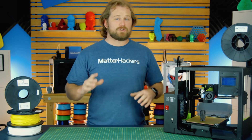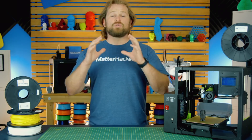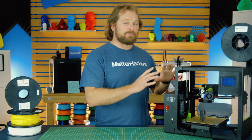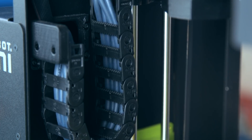There are four features about the Lulzbot Mini 2 that I want to dive into. They're pretty subtle, but hugely impactful for how the machine performs in general. The first I want to talk about is the Z-axis. They have gotten rid of the vertical lead screws, which means we have a belt-driven Z-axis — that is awesome.